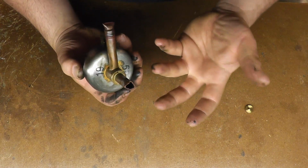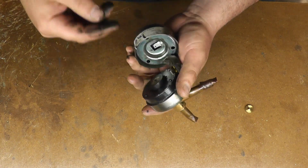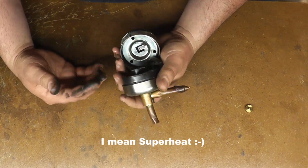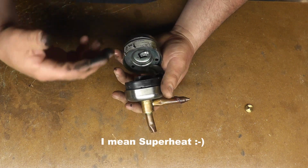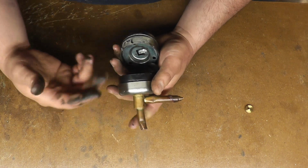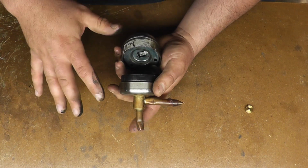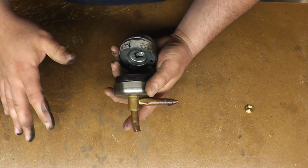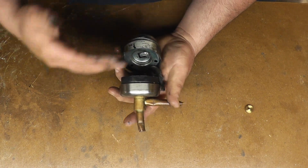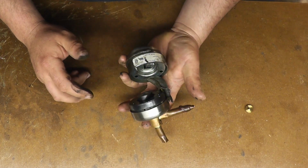The only good thing about this is that, because of the sensors, it has on-the-fly subcooling adjustment. In other words, it can adjust its subcooling right then and there, because it's actively sensing the suction pressure, the inlet pressure, and the outlet pressure, inlet temperature and outlet temperature. So it can automatically adjust the subcooling on the fly, which makes it more efficient, which is ridiculous.